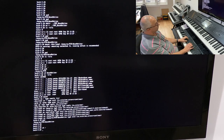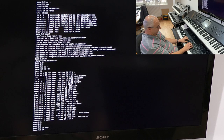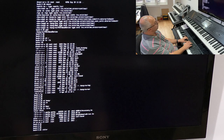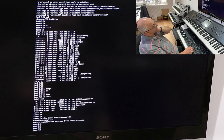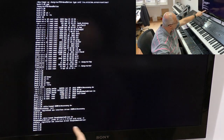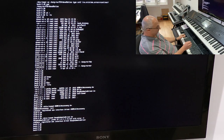So if I go into Korg and CD into read write, no, it was read only, sorry, it was a module. And if I install the module, the one I'm looking for is USB MIDI accessory, driver installed successfully, as you can see. And then the next one is the Korg audio driver. It says failed, error 5, don't worry. It says underneath registered, fine. So don't worry about that too much for now.